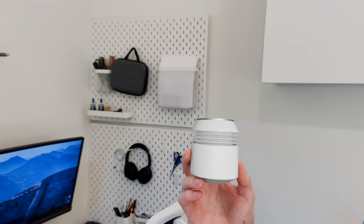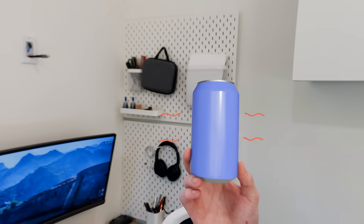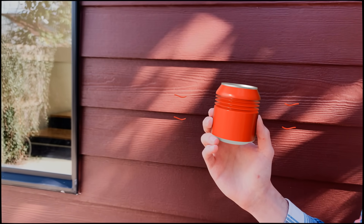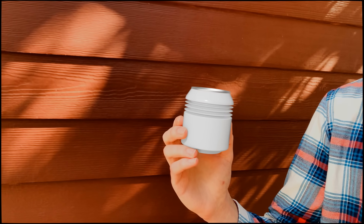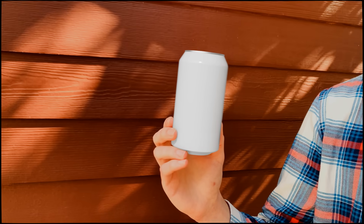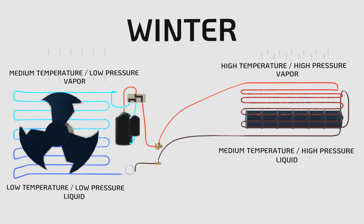To show how this can help us, I'm going to start with a pre-crushed can inside of the office. I'm trying to lower the temperature of this room, so I'm going to allow the can to expand back to its original shape, which will cause the pressure inside to drop — it's going to start absorbing heat from the surrounding air. Now that we're outside, we can crush the can again and it's going to become hotter than the surrounding air, so it'll reject the heat that we just absorbed inside. You can think of it like we're using pressure to turn this can into a sponge that absorbs and releases heat where we want it. If we wanted to heat up the inside of the shed, we could use this same can — we would just expand it out here and then crush it inside. This is how a heat pump works.